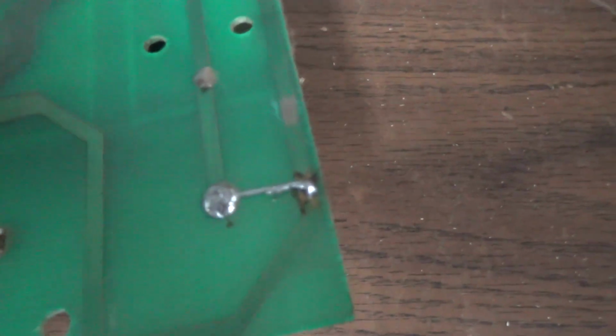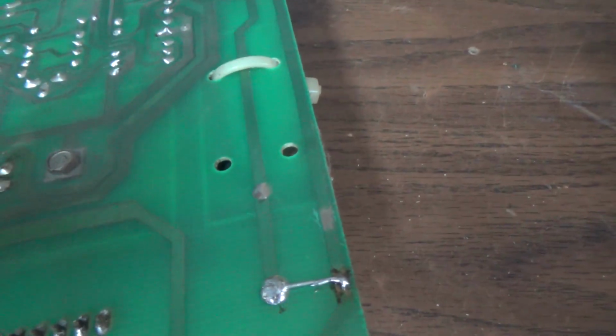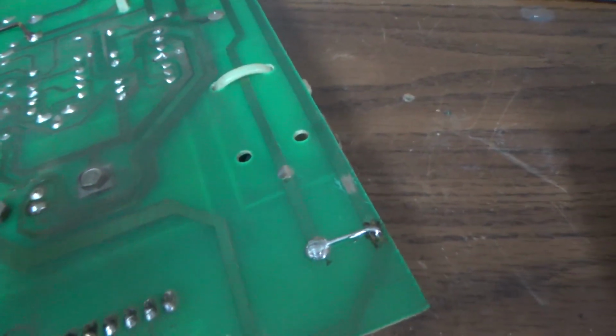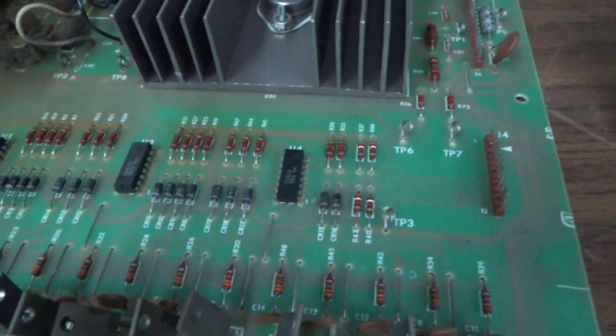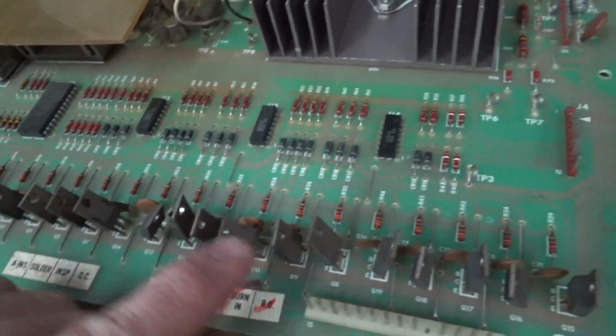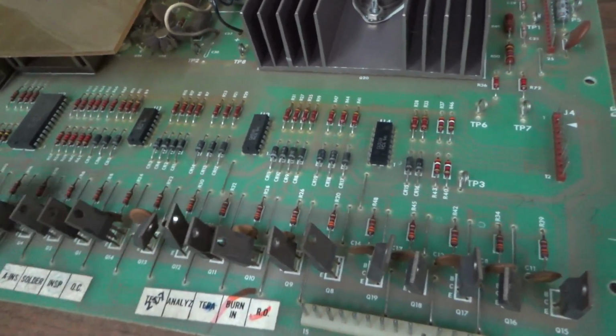They have also tied the ground from the display filter capacitor to ground. They have also reflowed the pins. Somebody's been watching my channel. Very cool. All right. I need to test all of these to see if one of them's bad. That could cause our issue.